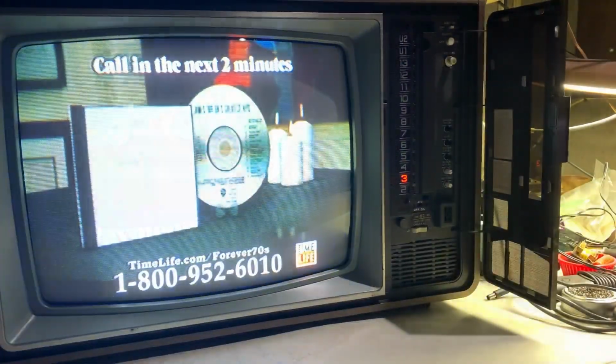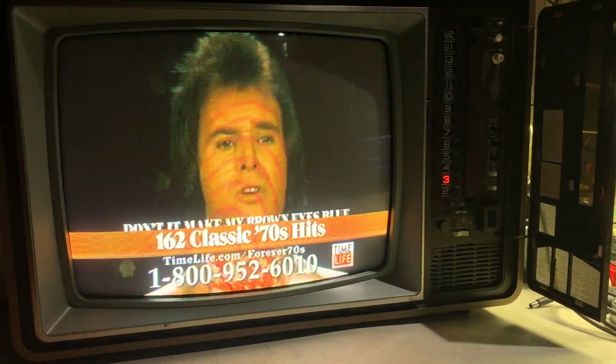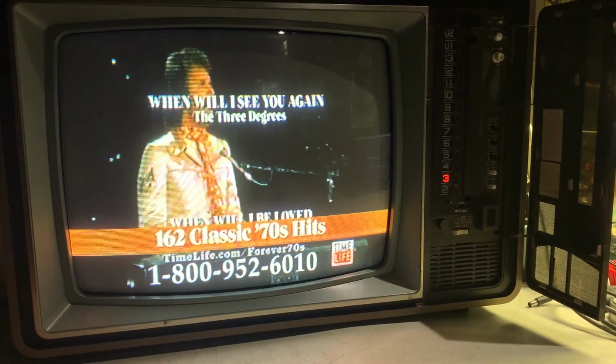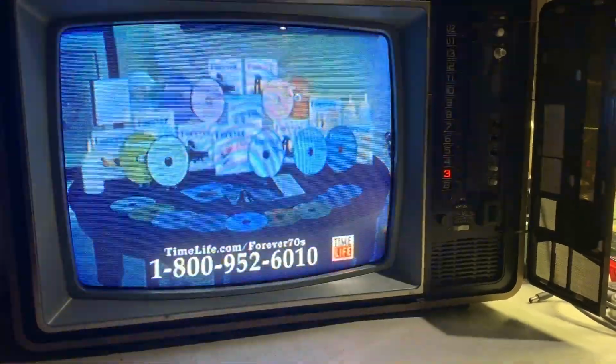Mute. I'll just press channel up or down. Get the idea. Now, I do have the color killer properly set. But it takes like a full half second for it to kick in, going from a color signal to a non-color. Pay attention to the colored snow for a bit when I switch channels. See, then the color killer kicks in.